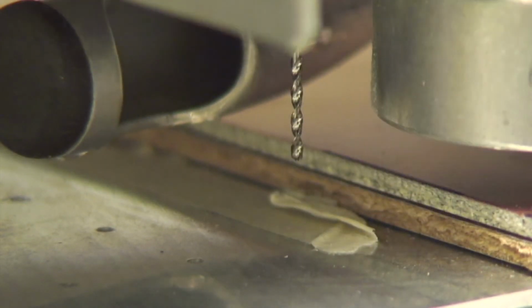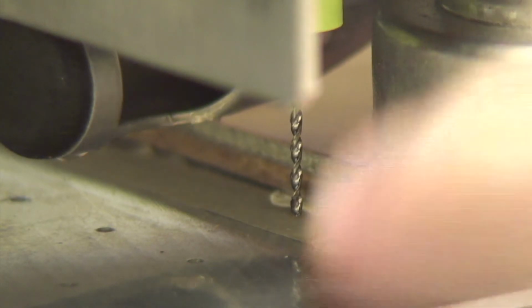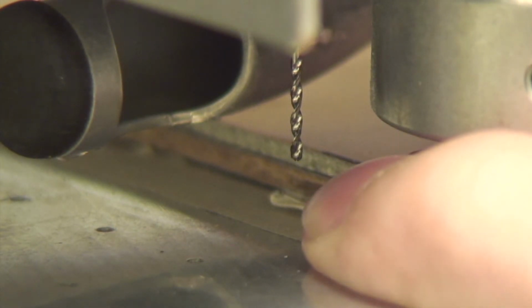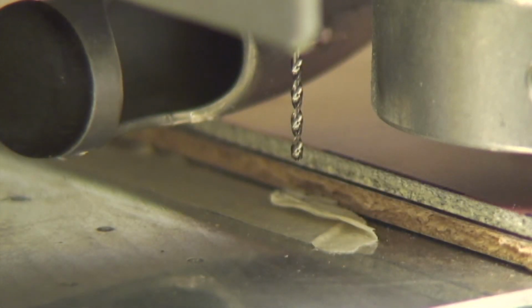Okay? So now even if you jam down the mill head, the foot will stop it from going any further, and the drill will only go about halfway through the aluminum sacrificial board, which means it goes all the way through the copper clad. Now, something to keep in mind is that you don't want to go too little into the aluminum board, because if you don't go deeply enough, then the little conical section at the very tip of the drill bit will wind up embedded in the copper. And so rather than getting a full circular hole, you will get a circular hole with a slightly lesser diameter at the bottom, which is where that conical bit hit. Okay? So you want to go a fair bit into the aluminum section to make sure that you're well into the drill bit by the time you pull up.